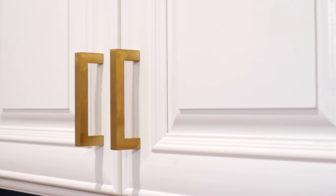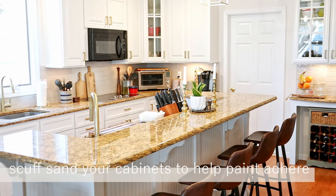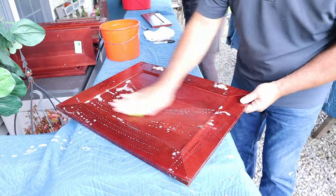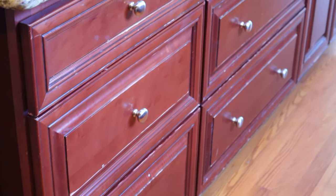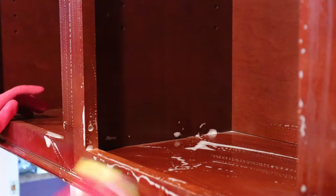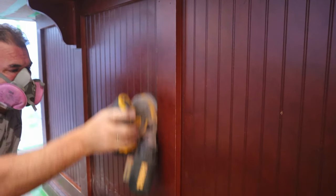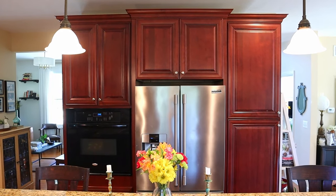Next is one of the most important steps in this process to get a long-lasting professional finish. Scuff sanding your cabinets and doors will help the new paint finish last for many years to come. You may wonder why not start with sanding and then do the cleaning to clean up the dust — but sanding your cabinets first can cause dirt and grime to be caked deep down into your surface. Sanding also makes your wood more vulnerable to water, so we always recommend first cleaning, then covering your surfaces, and then sanding. You can use 220 grit sandpaper and either sand everything by hand, which is time consuming, or use a sander.